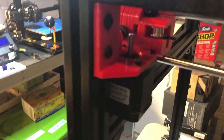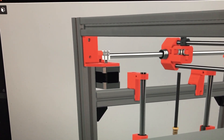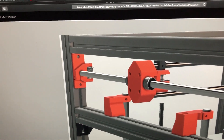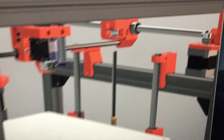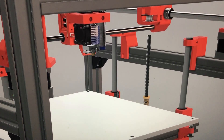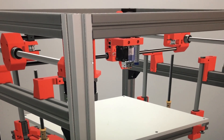The first thing I'm going to do is put the little idlers on the motors. On the CAD diagram here in Fusion, you can see that this idler has the teeth on the top. If I spin it around and look over here, it's the opposite — the teeth are on the bottom. That makes sense because on the front right this is on the bottom, and on the front left this is on the top. So I'm going to go ahead and get those teeth on there, and then I'm going to cut the belts.